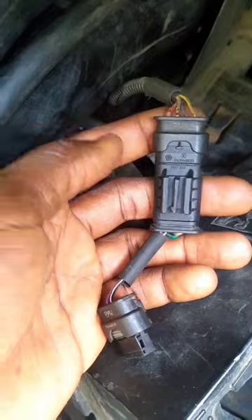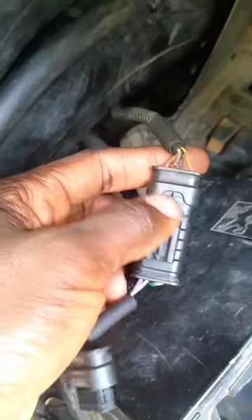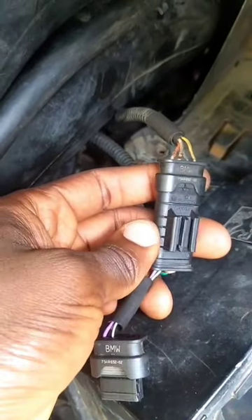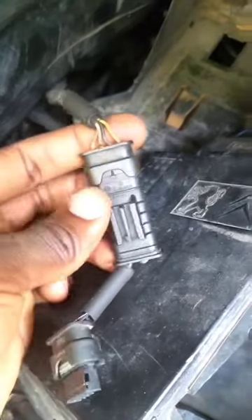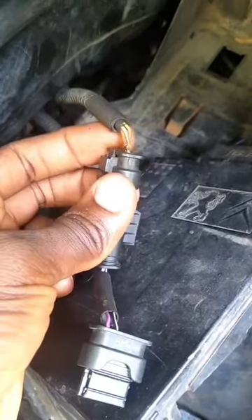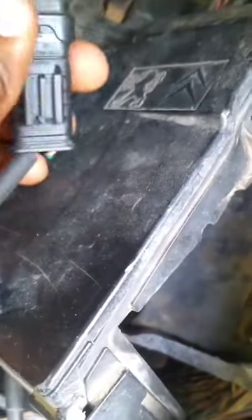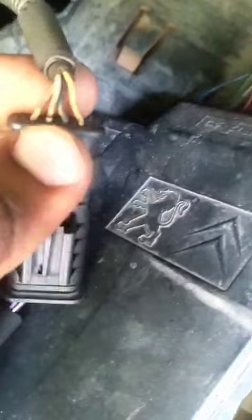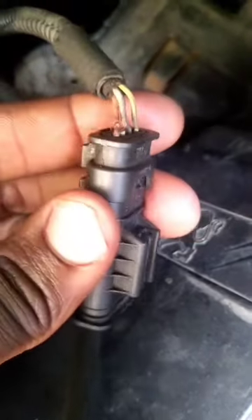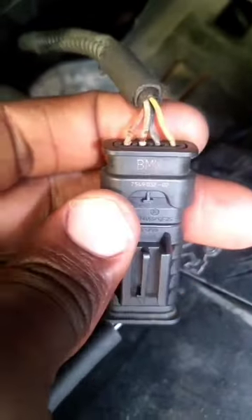So on the THP engine, I wanted everything inside the car, but I observed the thermostat still refused to open — which is what happened before. So I used my PP2000 to test the thermostat, to know if it opens. That's when I found out it's more of a mechanical-electrical issue. When I pulled out the wiring connector from the vehicle wiring harness, I saw these two wires going to the thermostat connector, and they were touching each other.